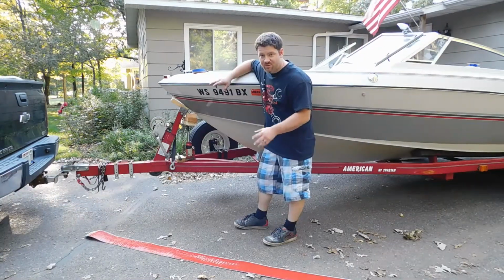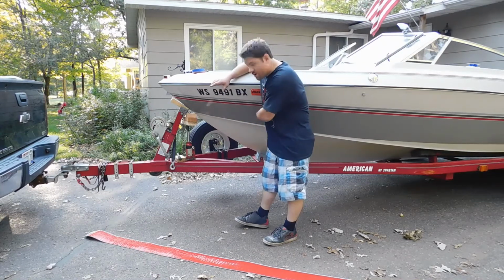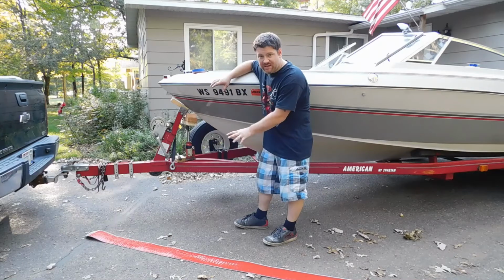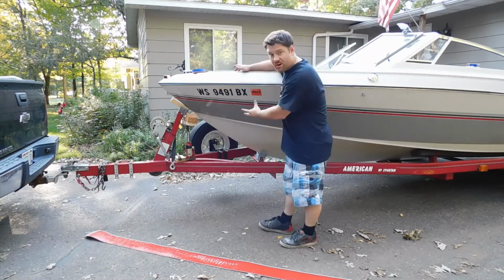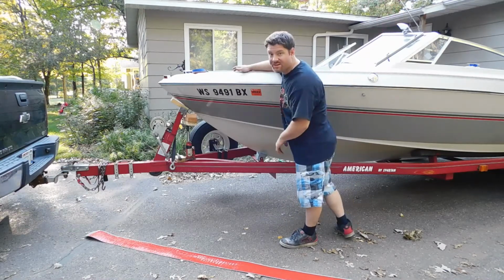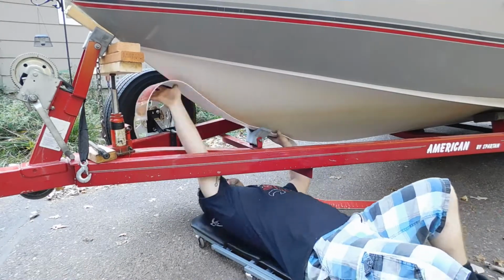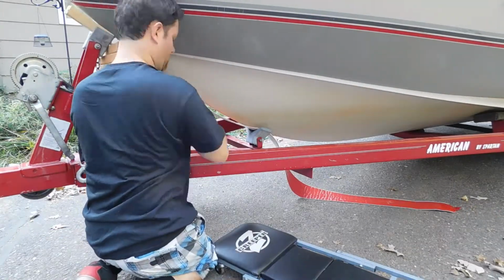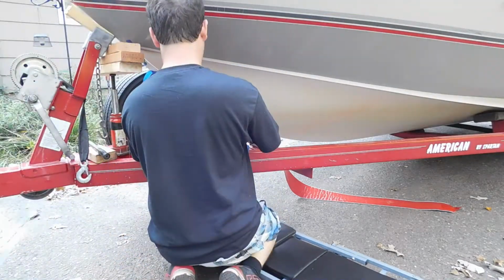The next step is doing a dry fit. So what you want to do is tape the keel guard where you're going to have it without taking any of the adhesive off. Mark it out with tape as tight as you can and then mark it for where you're going to sand. There's a few things to note here in this scene. I ended up just marking out roughly where the keel guard was going to go and ultimately decided to just get rid of the markings altogether.